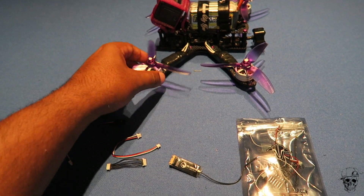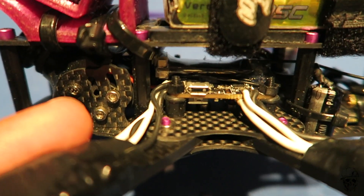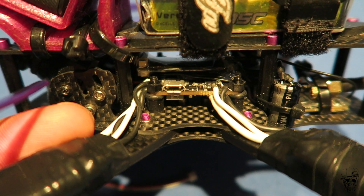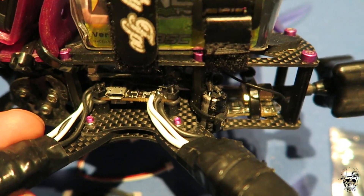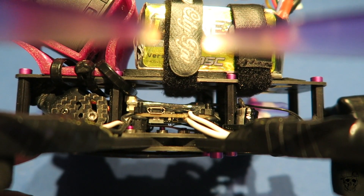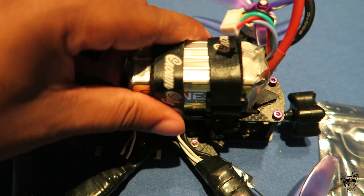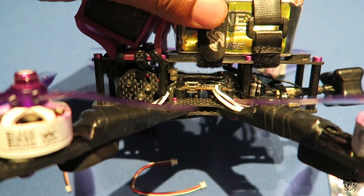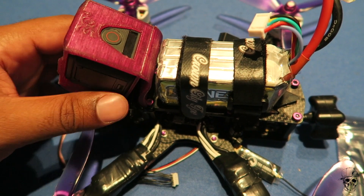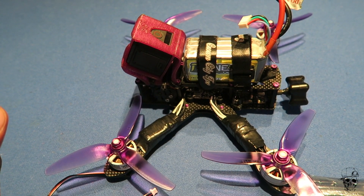Test it out before you make everything permanent. I actually glued the Crossfire receiver right above my Betaflight F3 flight controller. I still have my TBS Unify back there, but I used wire and zip-tied it to the top, which got in the way of the battery and Velcro straps. So now I've freed up the back portion and I'm using two straps — it's a lot safer and you don't have to worry about it breaking. If you have any questions, let me know — I'm always willing to help. Happy flying, have a great day!